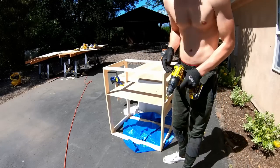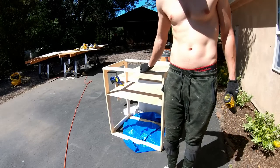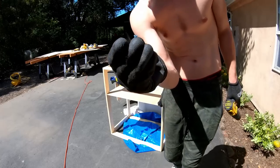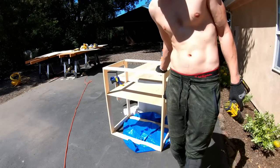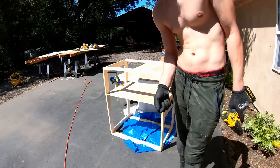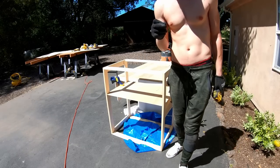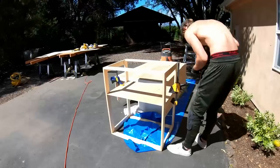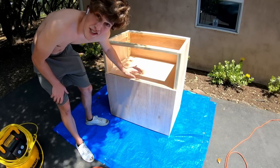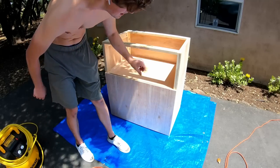The next step is screwing the faces that you cut out into the frame. You want to be careful not to screw from the outside in so that you won't see the backs of the screw heads. With a combination of pocket holes and extra long screws from the inside you can usually accomplish that. You also want to drill a pilot hole before you drive any wood screws in — that will prevent the wood from cracking. We've got ourselves a fridge drawer with full sliding action — I put it on 250 pound drawer slides, so hopefully that's enough.